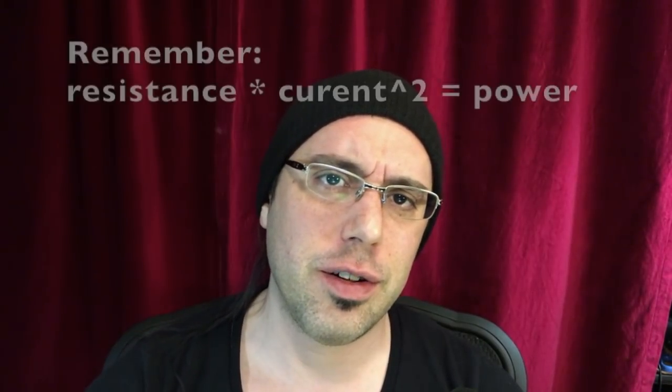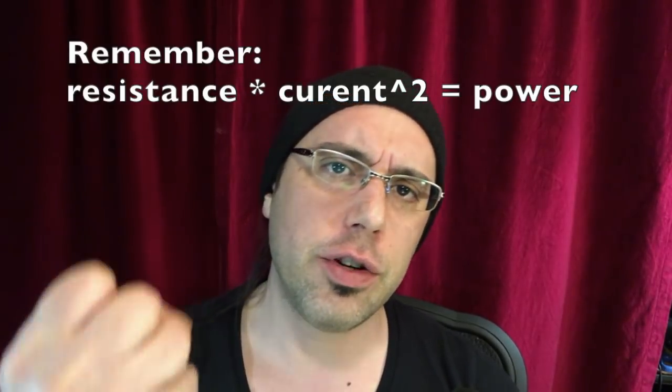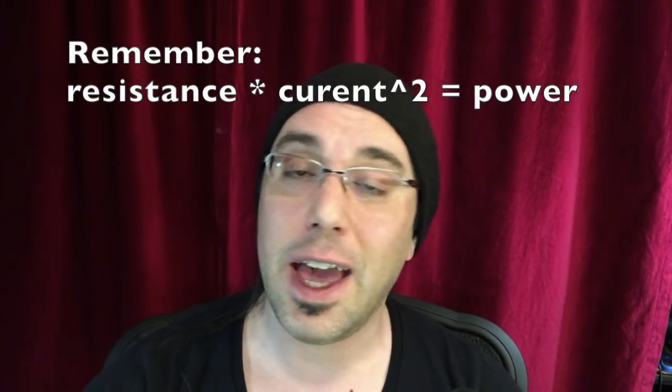As I alluded to when mentioning Ohm's Law, the biggest issue we're going to have is resistance. Our current is going to be whatever it needs to be to feed our bed, and it's going to try to pull that no matter if it can or can't. Think of electricity as running water through a tube — if you have a large diameter tube, it's easy for a lot of water to flow through. Same with electrons. But if that tube tapers down to a smaller area, you're restricting the flow a lot more. That's your resistivity, and the byproduct of that is heat.